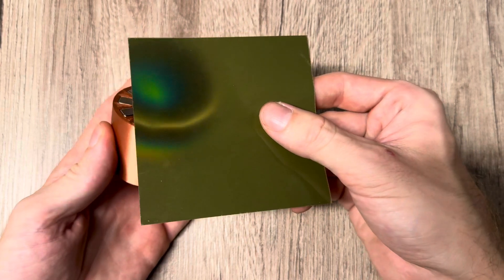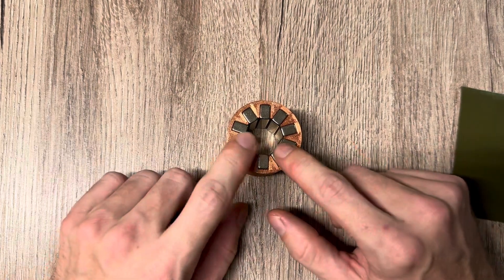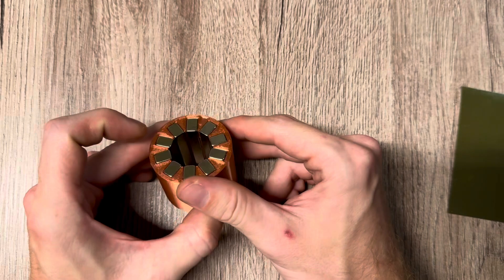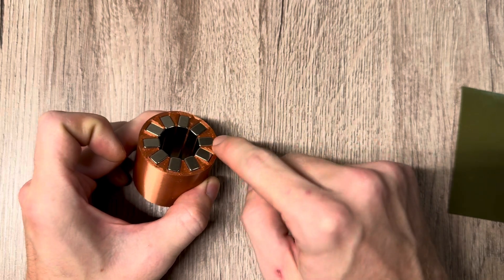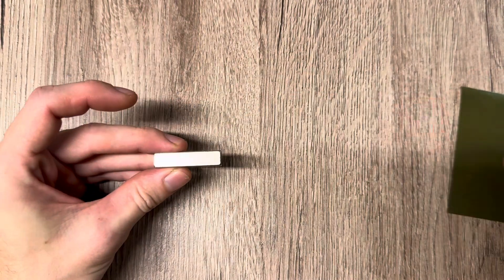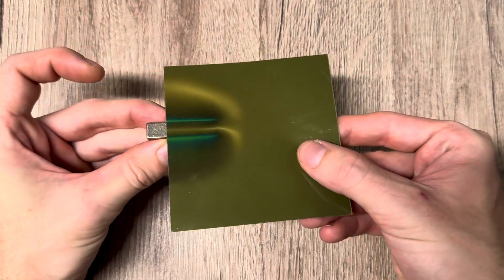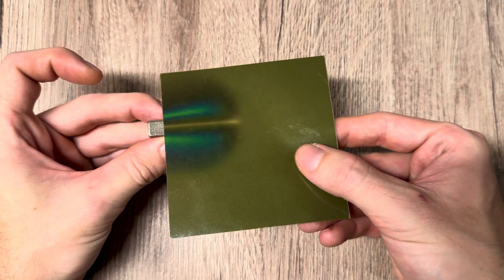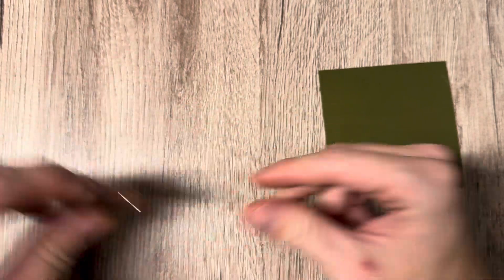If I view it from the side, you can see the outside where we have our north pole separated by the white lines, and on top and bottom we have our south poles. I'll quickly show you how I made these arrays and what magnets are used. All of the south poles are facing inwards, and the north poles are facing outwards. I used magnets magnetized along this plane — as you can see under the field viewer, the white line separates the polarities: south pole on one side, north pole on the other.